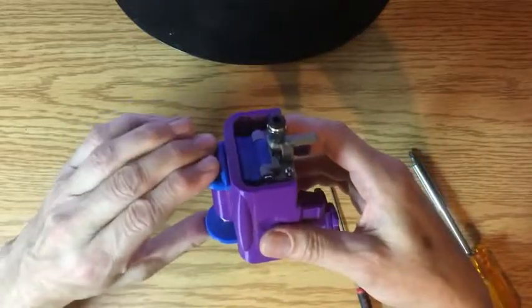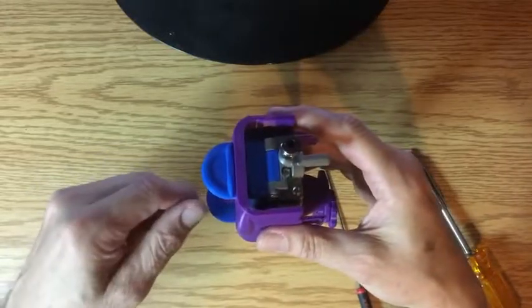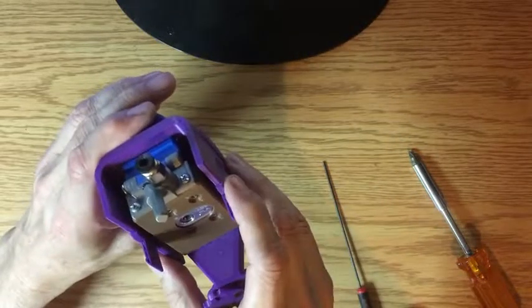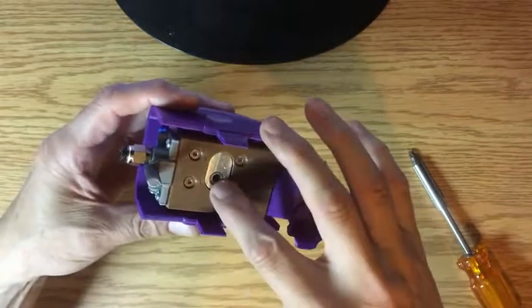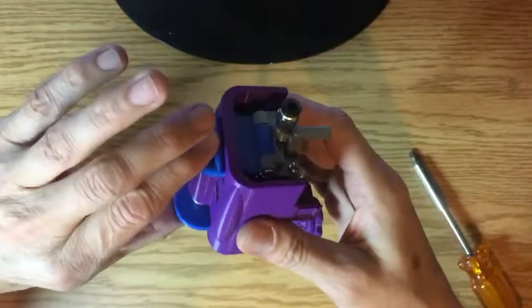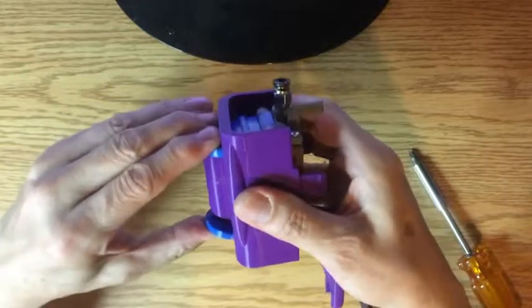The reason I have this on here is because if I ever get the gear thing working, you'd have a knob here to turn the main gear to feed or unload the filament. And if you're doing a purge to get the filament out of the hot end, you need to release the drive mechanism so you're not fighting it. To release it, it's real easy — you just squeeze these and it pops out. To put it back in, squeeze it and then push inwards like that.